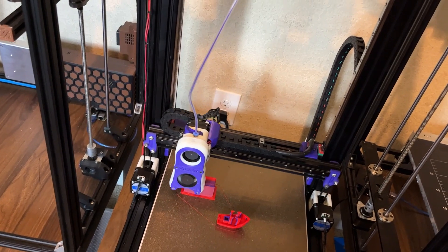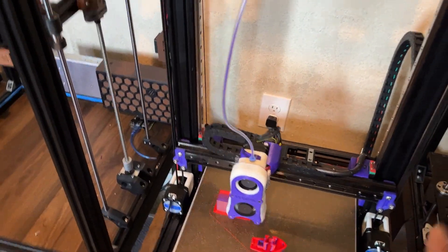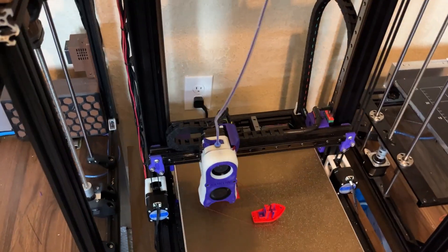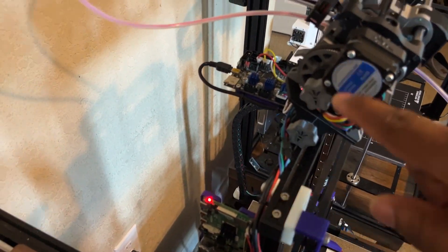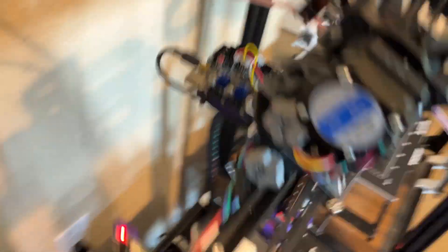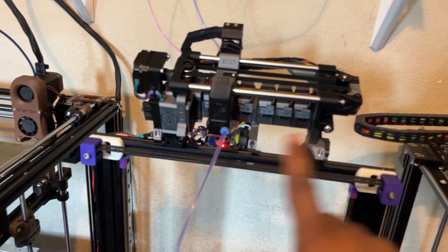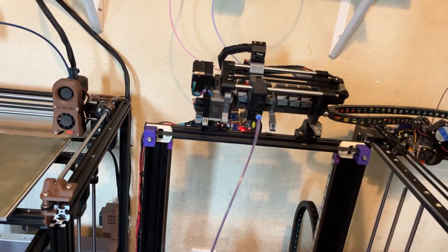I'm using a 500W heater underneath it. Not that I'll ever hit 100 degrees on this — it's really to print PETG and PLA for multicolor prints. I just wanted it to heat up faster. I also wired everything up neatly. My Raspberry Pi is permanently mounted back there. The extra board is an SKR E3 Mini 1.2 to run the Rabbit Carrot Feeder — neatly mounted. This is a 6-port version. I was going to build a 9-port, but that was a little overkill. 6 ports is plenty.